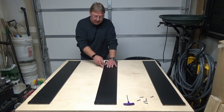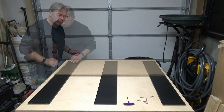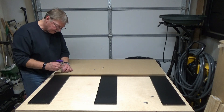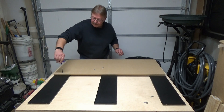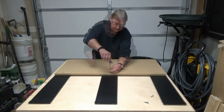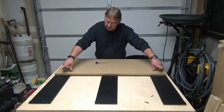The first step is to lay out your cross straps - right now they're about 12 inches apart. We'll go ahead and grab one of the MDF boards, put it on here, and put a couple of screws in it. They do come with Allen wrenches that are metric, but I bought a set of T-handles that I think are going to come in handy. We're going to start in the center and install these. When tightening these down, we don't want to fully tighten them - just turn them in until they stop, and we'll come back later when we square up the table.